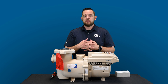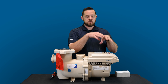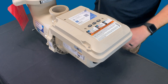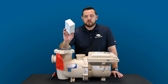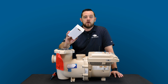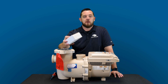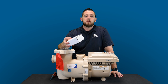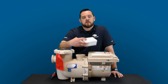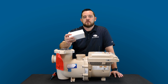We will have a video showing you guys how to get this installed out in the field. But right now I just want to show you guys how to install that I.O. board inside the pump itself. They ship it separately direct from Pentair — you'll see that in my What's in the Box. It comes in a nice little white box. The entire reason for shipping it separately: one, it is an electronic board wrapped in an anti-static bubble bag, and two, they want to make sure it's not pre-installed on the pump and damaged in shipping.